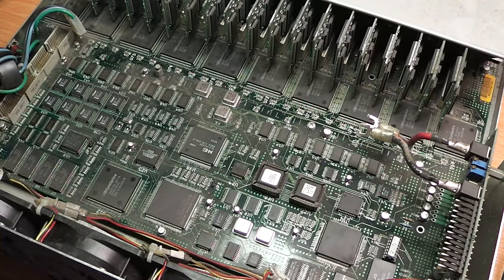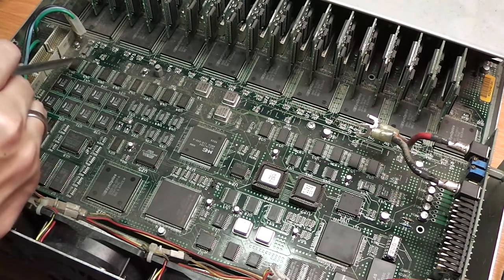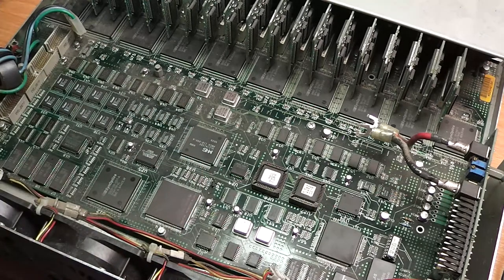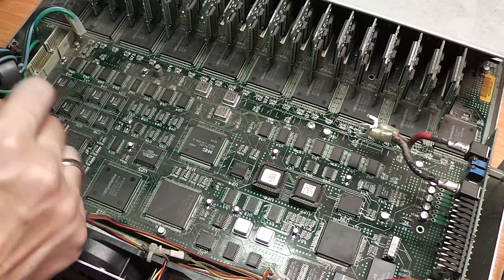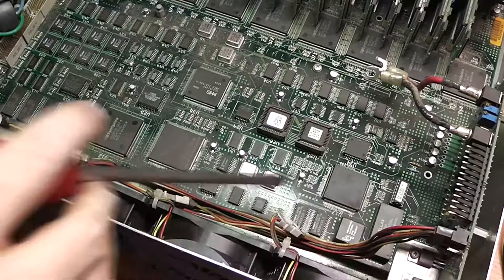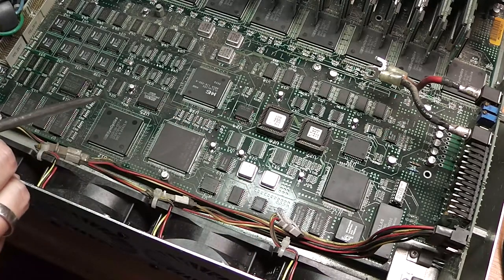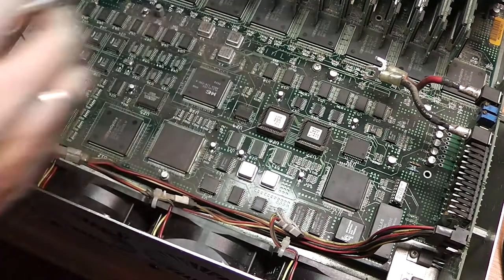Okay, so very interesting, very pretty design. What we can see here is a couple of the HC244 buffer line drivers, three crystal oscillators. We see the main CPU, which happens to be a MC68EC040. It's a 32-bit Motorola CPU. See some Altera device that I don't recognize. Some flash devices up here, which might contain a firmware or NVRAM actually. These two devices here look like they are DC-DC converters. Then there seems to be some PAL logic here. It's a 22V10H. Another two quartz crystals and some misc parts. So really interesting. I'm now trying to get the boards out, and then we'll see further.